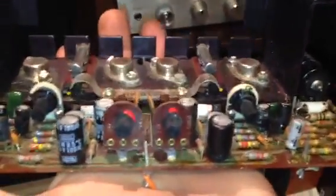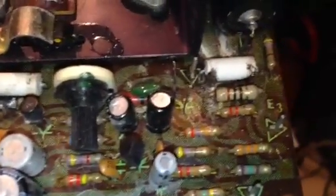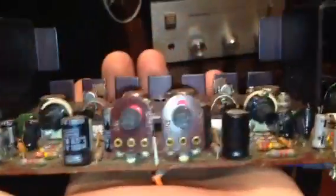I got tired of using the DC-powered amp in here — I'm going to use something different. I've got a Pioneer power module over in the window. I'm probably going to use it in the Marantz because I can't find the original Marantz amp. It's a really good, almost no-noise power amp, about 40 watts per channel, but I've got some parts to replace — a couple of driver transistors are bad. I think a transistor on the right channel shorted and took some capacitors and the driver transistor with it. I need to order parts and also replace the bias trim pots with some better five or six-turn ones.